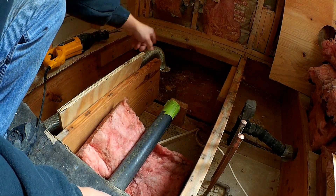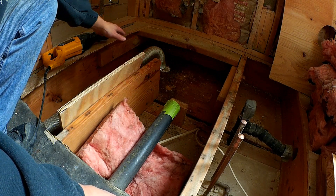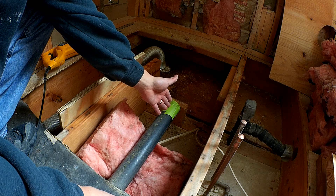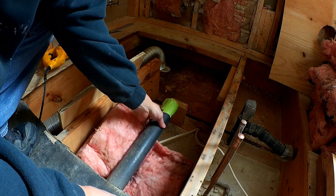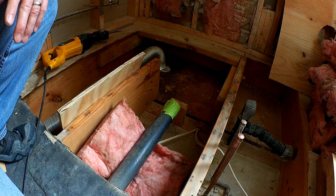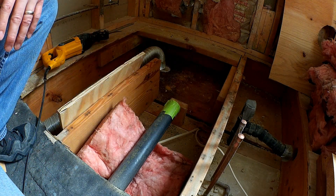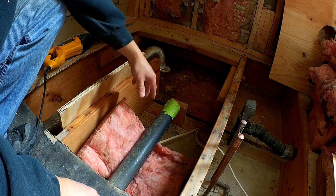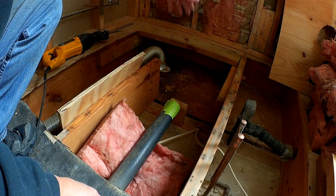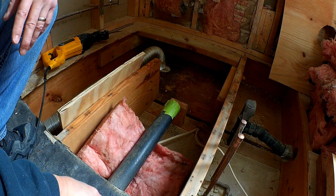As far as plumbing is concerned, the pipe is actually in the right place, because this is the start of my shower wall and it's actually at 21 inches — exactly where it needs to be. I can move it a little bit here or there, but it's essentially centered. I don't really have to do a lot of bending. I can adjust it as needed with the new P-trap that I put, and I just need to make sure I center it from side to side. I'll cut that off and make it fit the way it needs to.